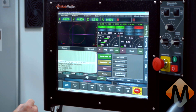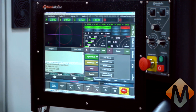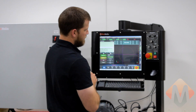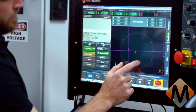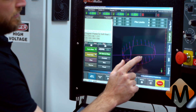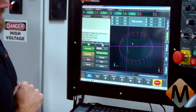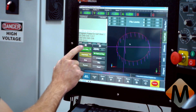Exit the conversational program. As you can see, I now have a circular hole pattern. Now I go to the tool path screen. Here you can see the bolt hole circle pattern. We are now ready to run the part — hit cycle start.